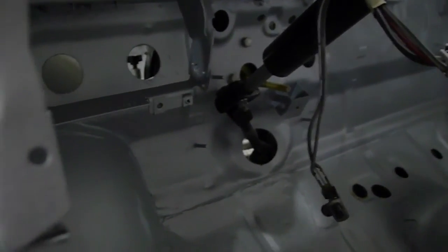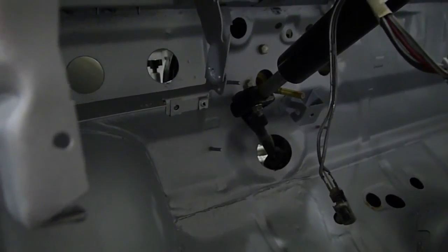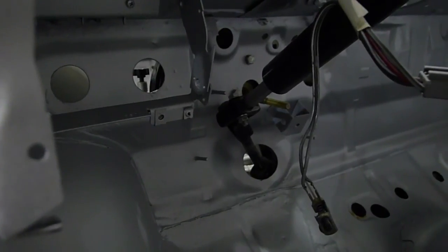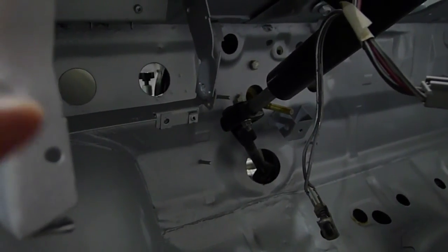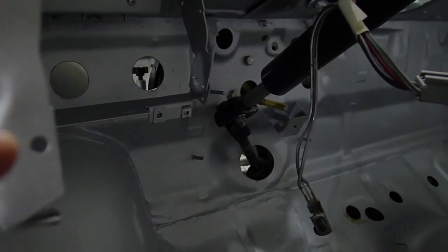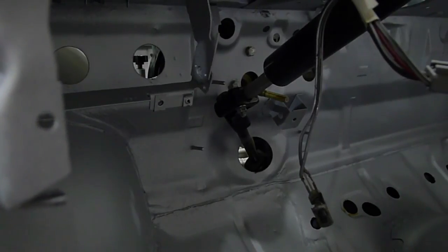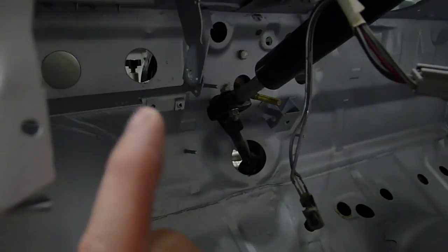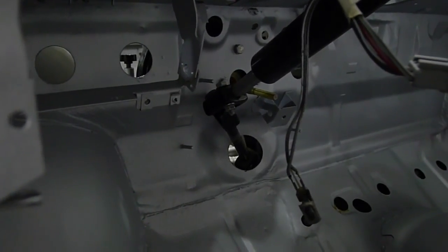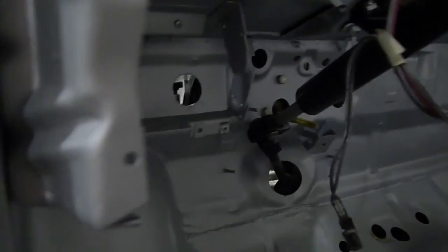Can't seem to get any decent Mark 1s. It turns out that the Mark 3s at the ZF steering box steering rack end have the same 11/16th, 40 spline count, so I've ordered a couple of those off eBay from some late 1990s Mark 3s and I'm going to see if I can fabricate — take the two ends and make one new u-joint assembly out of it.